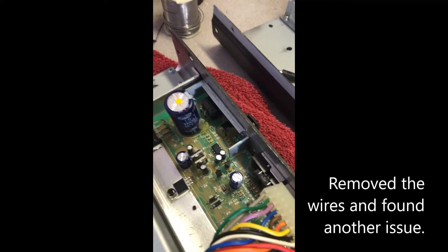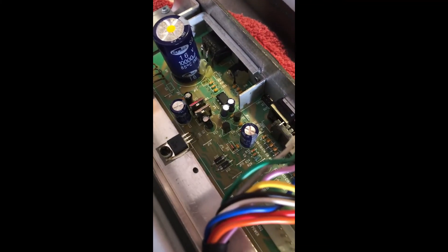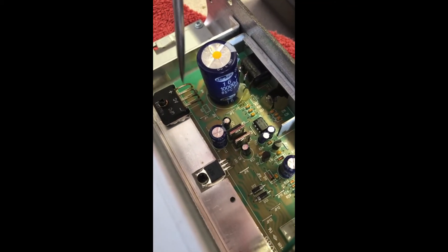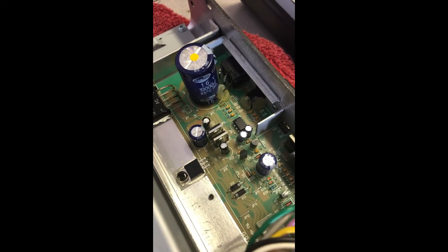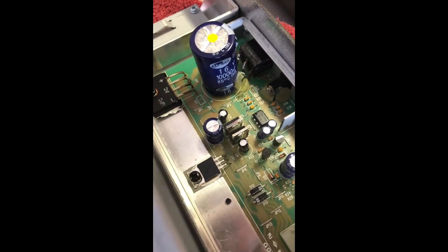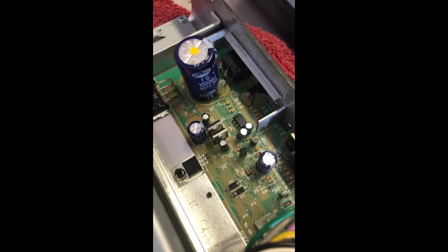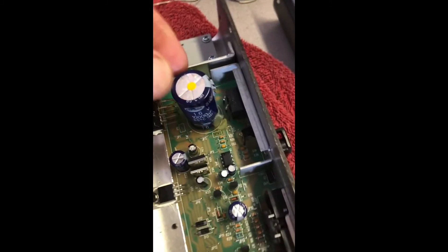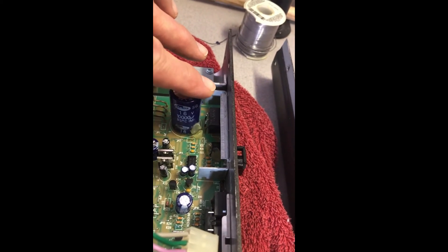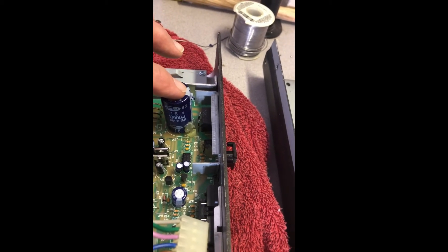As I started digging in, a previous repair had run a wire from here to the switch and from here to the terminal on the bridge rectifier — apparently believing the power was not connected. I ran resistance checks between those points and the circuit board appears intact. The bridge rectifier checks out on the diode test. Interestingly, the capacitor feels like it's moving on the board, so I'm going to pop this apart and see why it seems loose.